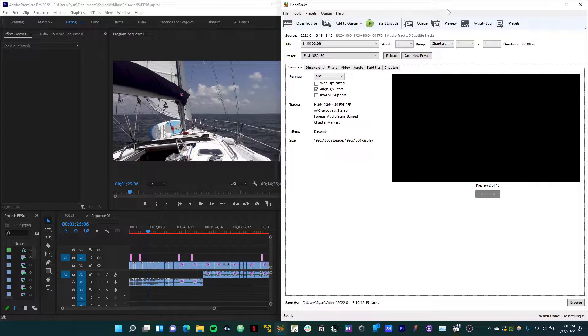This can be very important because when you think of the power draws on your boat — if you have a small or medium-sized boat — generally your largest power consumption draws from a 12-volt perspective are going to be your refrigeration system, your lighting, your instruments if you're using them frequently. Since we are in the 21st century and we all tend to use different gadgets, whether that's iPads for navigation, laptops for editing videos or playing video games, or your phone for communication, all of those little electronic gadgets tend to use a lot of power and can really add up quickly.